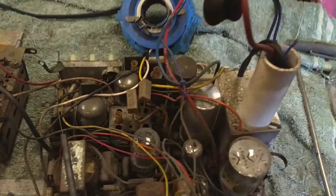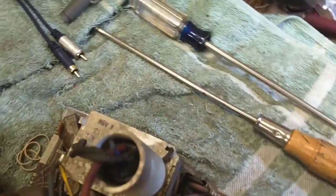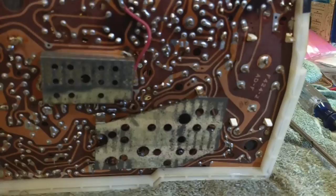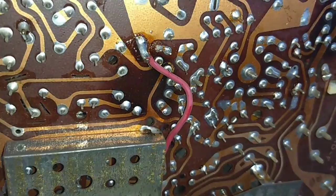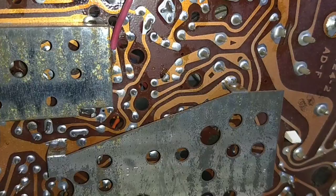The main things I want to focus on are the sweep sections, to see if we can figure out what's going on with the yoke. We've got these two capacitors here that are part of the yoke circuit, which may be defective. We definitely have to redo all the tube sockets, because just flipping this thing up and looking at the bottom, you can definitely see a disgusting amount of bad solder joints on the tube sockets. The horizontal, the vertical, the sound — pretty much everything on this board could use re-soldering.